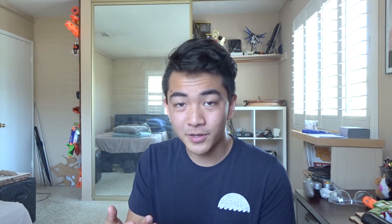The way I stopped killing them is so dumb. You remember how I said motors are made up of coils? Solenoids are just one big fat coil with a magnetic rod inside of it — my dumb ass forgot that. And I kept burning up boost converter after boost converter before I remembered: we can use a snubber diode. I've already used a snubber diode! Once I added that though, everything else ran perfectly.